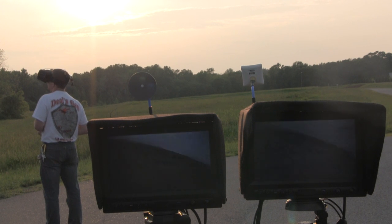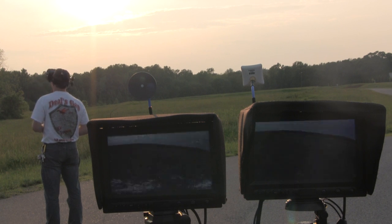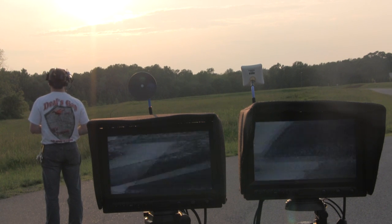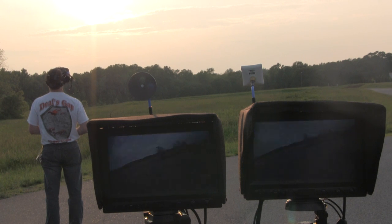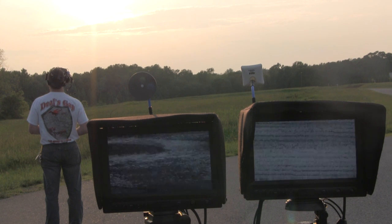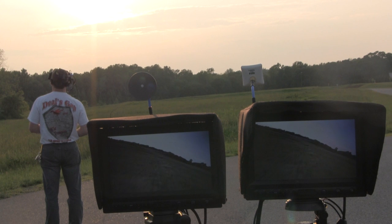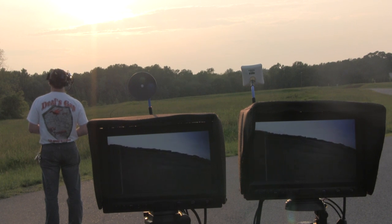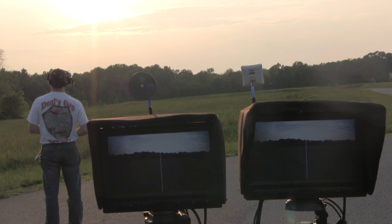At this point, I'm 45 degrees away to the left and about 2,000 feet out. I'm entering my field, and the trees off of my left shoulder are the ones you see right in front of you in the camera. As I make my way behind these trees, you can see the helical holds on and the patch has no signal at all. However, when I exit the trees, it's nice and clear. My guess is that the reason why the helical has better signal behind the trees is simply because the axial ratio of the helical — that is, the rotation capability — is better than the patch.